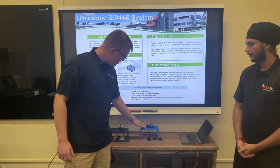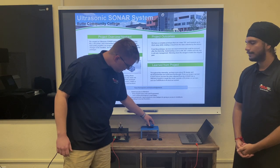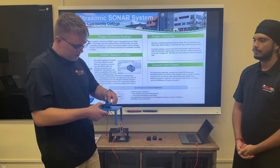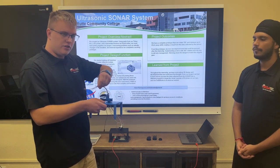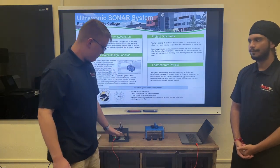In this model, we were actually going to have what's called a slip ring in here, next to the servo gear, so that the wires up here could rotate freely while the ones underneath could remain stationary and not get tangled up with the red board.